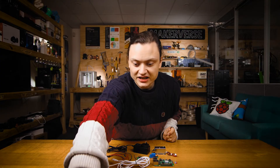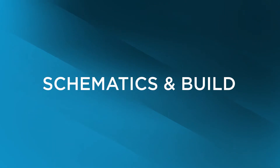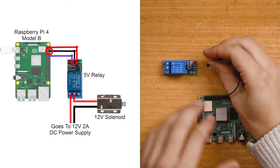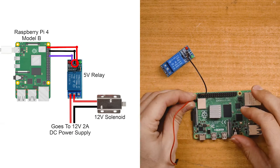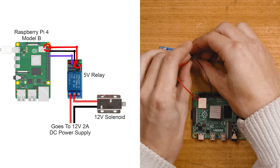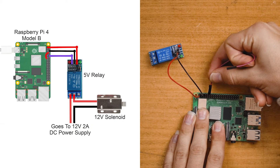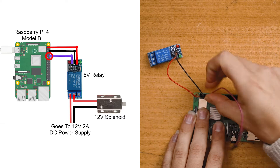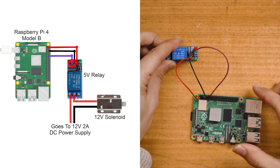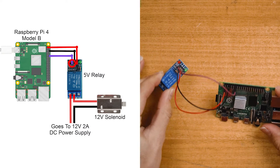You're also going to need a screwdriver. To start, connect the ground pin of the Raspberry Pi to the ground pin on the relay. Connect the VCC volt power of the relay to the 3.3-volt pin on the Raspberry Pi. For the data pin I will use GPIO18, which is pin number 12, telling the relay either to open or close — so connect GPIO18 to the IN on the relay.